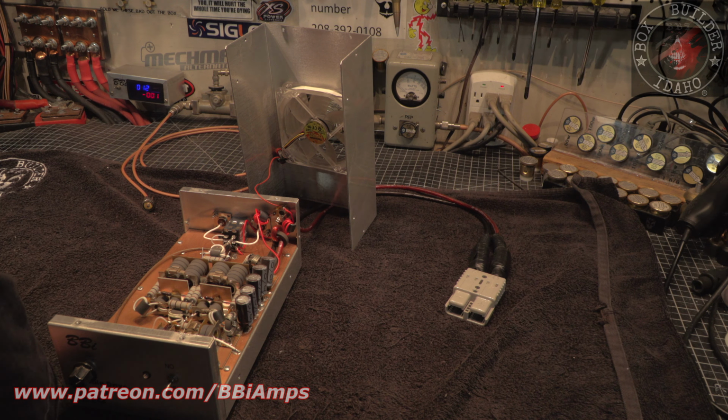So we're gonna pull all three of these transistors out. I wanna check this one. I wanna see how long this got run before it died, because it could have killed more than just these two pills. So we're gonna pop these three out. And the logic being that if this one's still good, the odds are probably pretty good that this one's still good. You know what I'm saying? But let's get to pulling and we'll go from there.